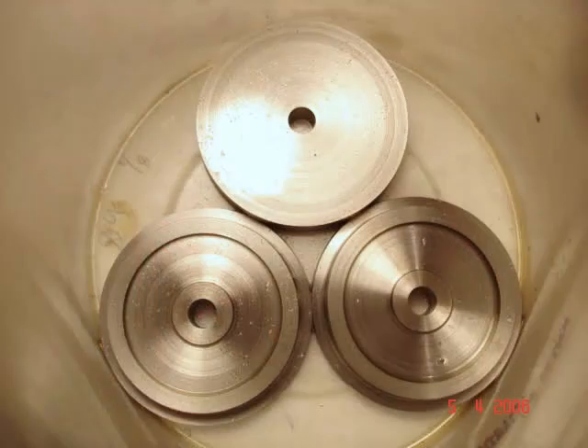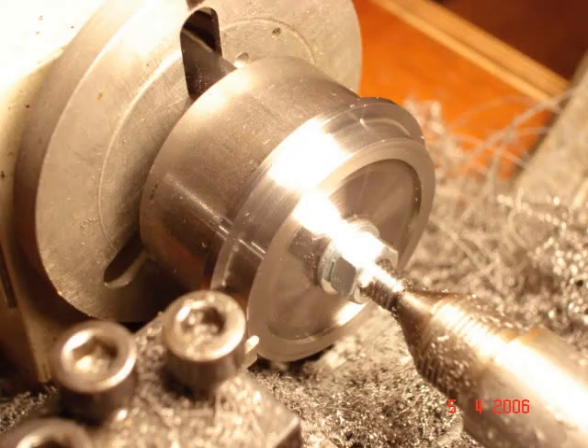This is the start of Jack's construction images — we had just bought a digital camera. Three finish-turned steel wheels oiled up. The treads are 40mm diameter. The flanges are 2.5mm deep to suit the LGB track; I made the flanges too shallow on the smaller locos at 1.5mm — should be 2mm for gauge 1. Here I am finished turning the 3-degree taper on the 4th wheel, using a between-centres mandrel on my bench drill-powered Unimat 3 lathe. Jack was solely built using this lathe setup.